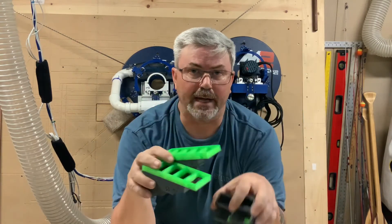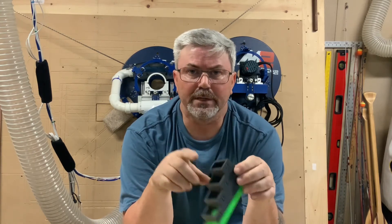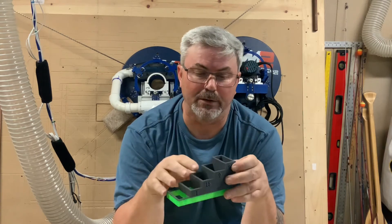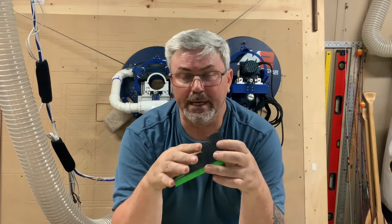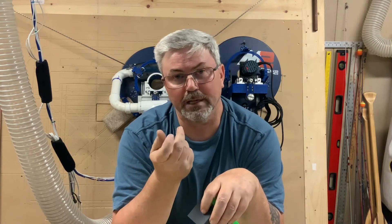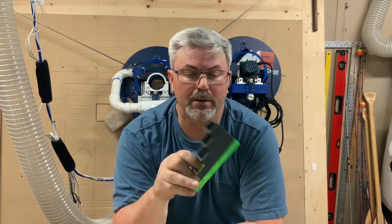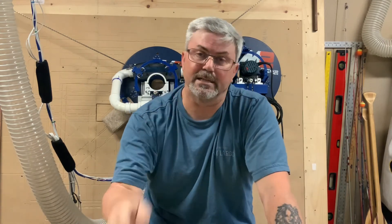That's it — real simple, real fast setup. Using these jigs, I can adjust from basically a half inch all the way up to two and a half inches thick wood. At the higher end you'll need a longer bit, and you may eventually bottom out the Z-axis height, so be careful of that. Anything between a half inch and probably an inch and a half is definitely doable, maybe up to two inches. These jigs let you always adjust the depth of your bit in conjunction with your Z-axis to ensure you never have a collision between your collet and your workpiece. I do plan on selling these on my MakerMade store — the Two Tankards storefront — as soon as the store is back up. If you'd like a set, reach out to me on Facebook. As always, if you like my videos please like and subscribe and we'll see you on the next one.